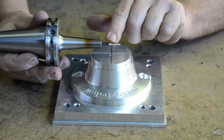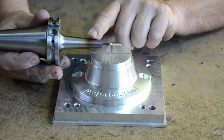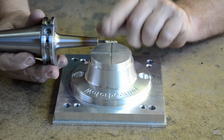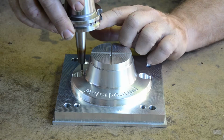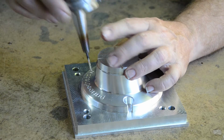And these parts are made from different materials. So this is steel, and this happens to be tungsten carbide. And they expand at different rates. So if you reheat this, it'll expand faster than that, so you're able to take the cutter out and reuse it. But okay, anyway, so I was able to get around the clearance issue by using one of these types of cutters, and that became really important when I was doing the lettering.